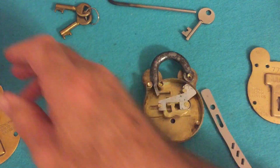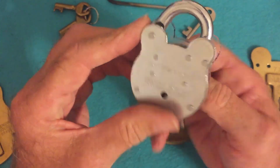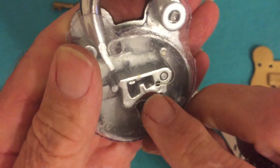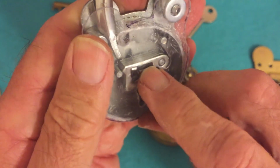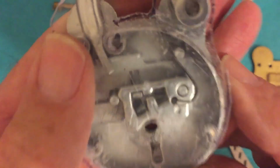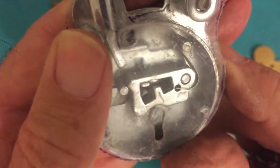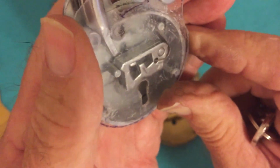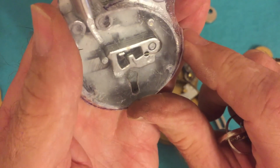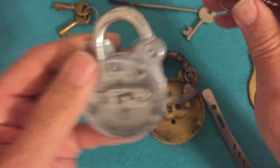And let's see here. This is another Squire lock. I believe it's 220. And you look at its levers too. It has, of course, the gate here, and it has the bolt stops up here, and they are almost as thick as the bolt itself, so it keeps it very secure. And you can't overlift these to slide the bolt over like you can the Jason & Sons locks.